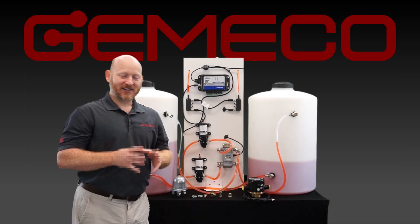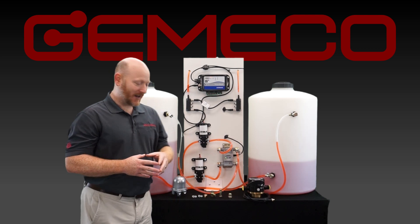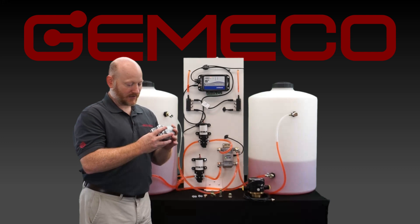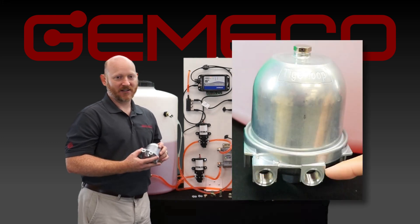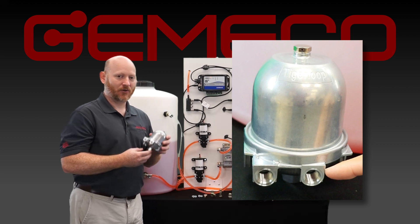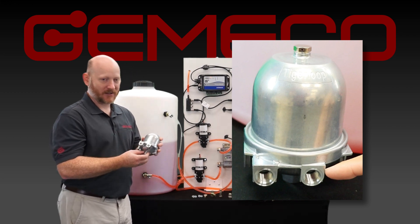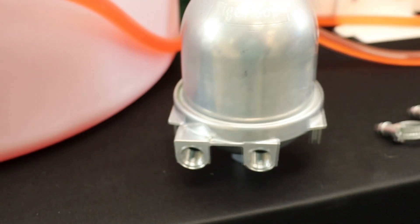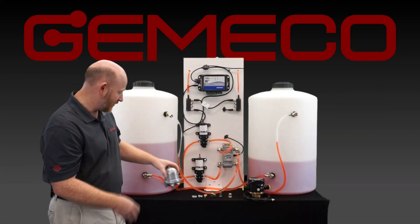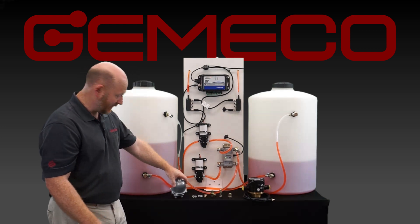Dealers love the accessories that we carry at Jimmaco, and one of the units we have on display is the diesel flow deaerator. The deaerator is an essential part of an installation — it lets you bleed the air from the diesel lines without having to crack into the fuel system. Not only is it a safer way to get air out of the line, but it's also a lot more convenient and clean. You're not trying to scrub diesel out of the bilge after you do the installation.